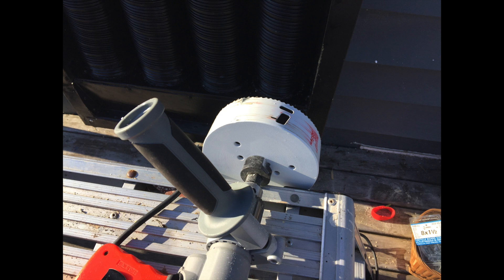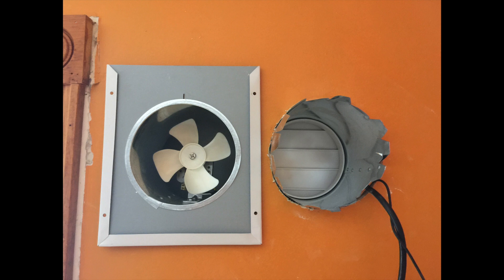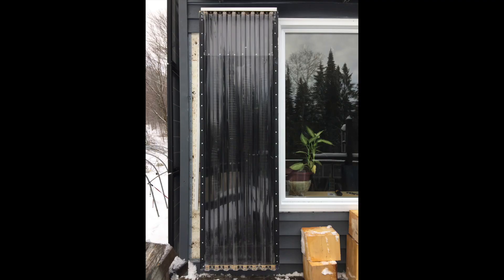The unit has to be brought out and installed onto the house — screwed onto the face of the house. There's some 1 inch insulation that's actually helping to insulate the back of the air heater. I have to drill 6 inch holes through the house in between the studs to allow for the intake and the exit fan to move the air through the solar air heater. All of this means that these air heaters have to be kind of custom designed in order to fit their space.